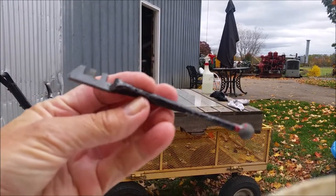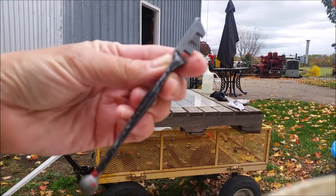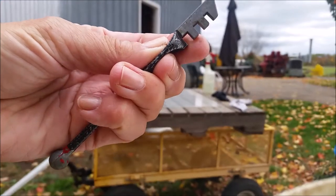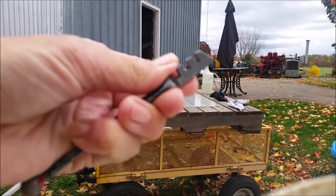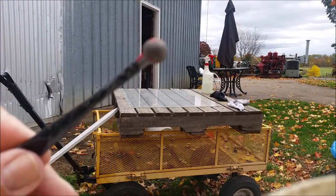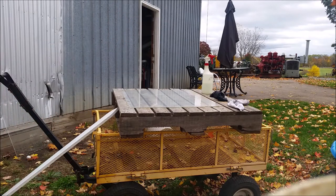These are really simple cutting tools and this is what they use at the hardware store for the most part. You can use them on different types of glass and tiles. I had been first taught that you could tap the edge, and that the little teeth were to file the edges so you didn't have any roughness. Some people use the ball on the end to tap it, which I do not recommend at all. So we're going to score our glass on both sides.